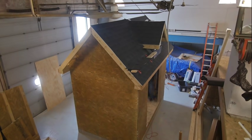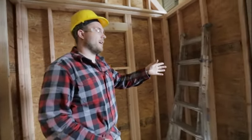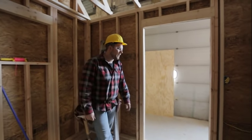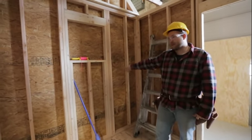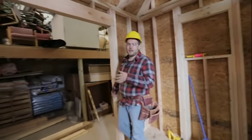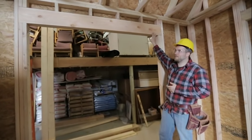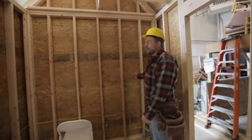For the next phase of our project, we have finished the floor, so we're going to move on to building the walls. For this project we have four walls, as you can see they're already up, and we have a few different components to each wall. Our front wall has a typical three-foot exterior entry door that we're going to frame in. On this side wall we have a 24 by 24 inch window that we framed out, and on this back wall we're going to frame in an opening that's over six feet, which has a little different framing for the header.